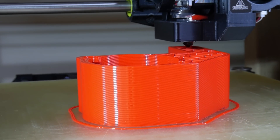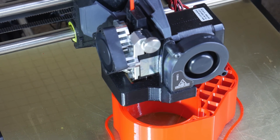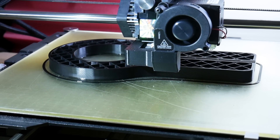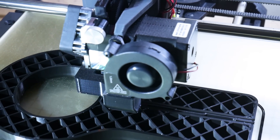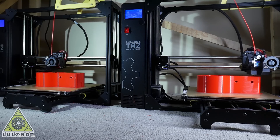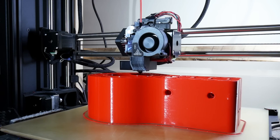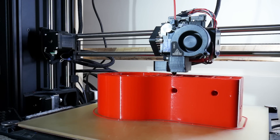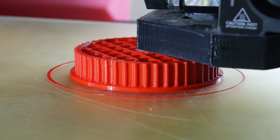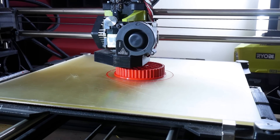There are some other parts with pretty complex geometries and the easiest way for me to make those is with 3D printing. These are PLA parts but I'm using a 1.2mm nozzle — you can see how fat the extrusions are — and that makes the parts really tough. These are mainly the pieces which bearings are going to go in, but we also have to make some pulleys so we can get feedback to a pot for the joints and also drive the servo to the right position.